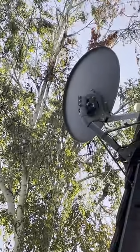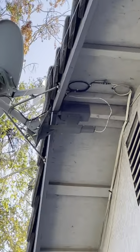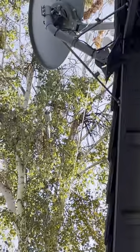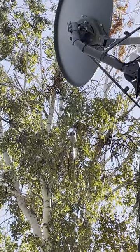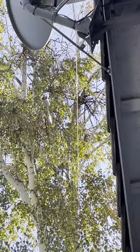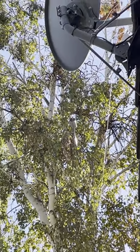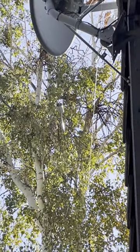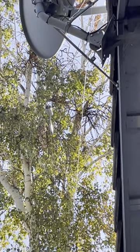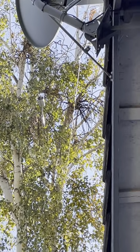It's 10 meters on each side, and at the end, I don't know if you can see it there, but it's a little coil, and the coil gives me the 80 meters. It's in the center. And I had to drop down the extra, it's like 1.5 meters, to get the 80 meters. But it works pretty well. And so I recommend it.